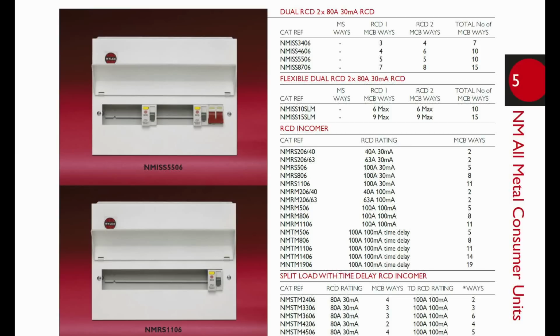And notice also that the cover, the hinge thing there which just goes over the circuit breakers, is also made of metal, which implies that all those metal ones currently on the market with a plastic cover, typically transparent, will of course be no longer any use. That means you've got a big hole in the front where you've got your plastic circuit breakers with a plastic cover over the front, both of which are probably flammable, so that's really no good either.